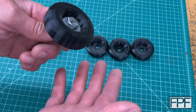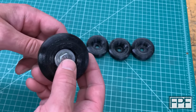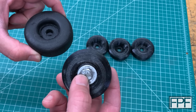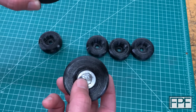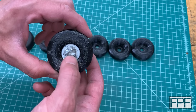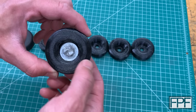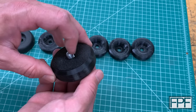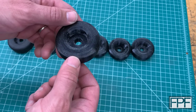Now, I don't always carry a full load in that trailer, but given the amount of wear on that plate, I think this one was probably bottoming out on the bolt head well before it was even fully loaded. So I want something that is essentially progressive, that's still kind of soft on the top, but also has enough crush to carry that full load further down.